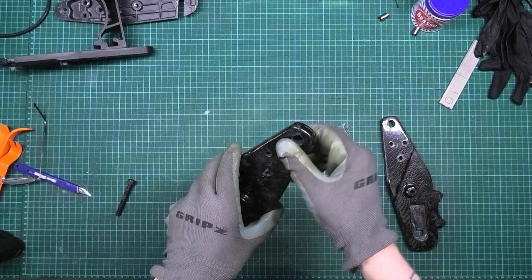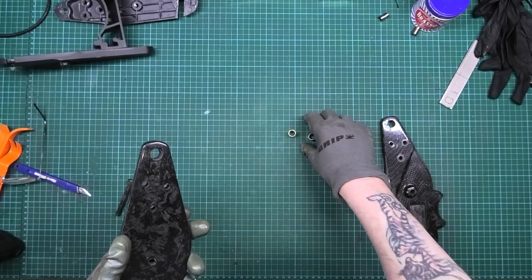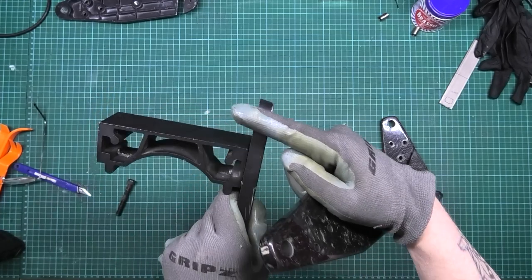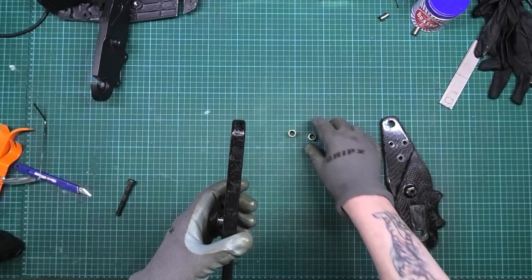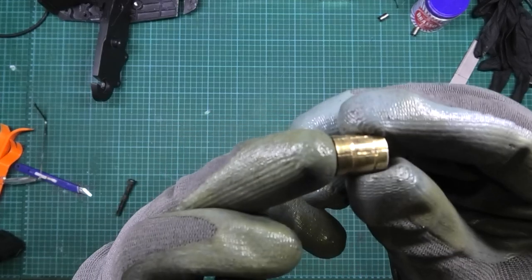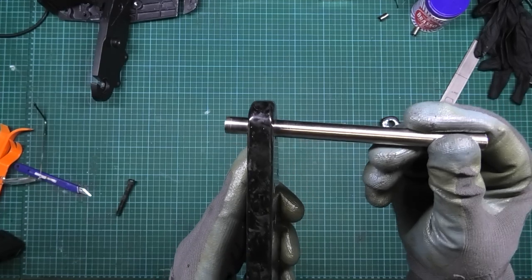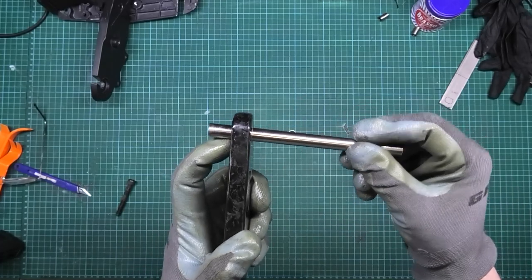I've been thinking of a way to mount the bushes or bushings that have to go in here. The original ones were just literally pressed in, but these holes aren't cut straight - they were coming out very slightly on the skew. So I've made these holes slightly bigger and I've keyed the outer part of the bushes up. These can go in here and with the bushing in there it can still move, it's free, and it can actually rotate a bit on the other one too.